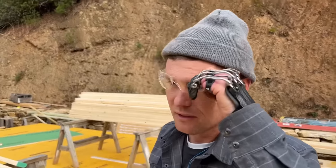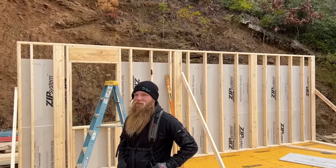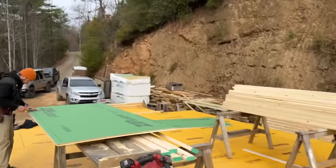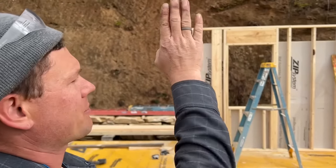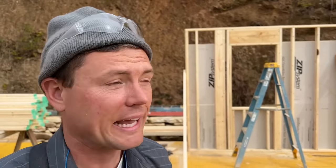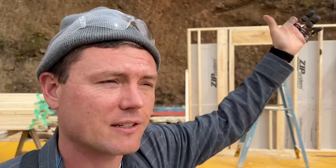A question a lot of people are going to ask: why does the sheathing stop short? Why didn't we go to the top of the wall? We're still developing our plans for the way the rafter tail is going to be cut. It's going to be a two-by-twelve. The end of the tail might have a vertical cut — a plumb cut — that extends up the vertical face of the outside of the wall. Given the chance, we'd like to sheathe across the wall surface and across the end of the vertical cut on the rafter to connect everything together.